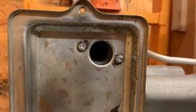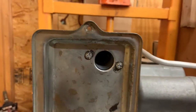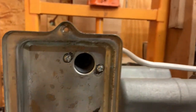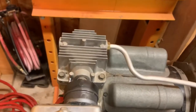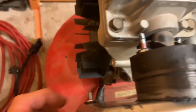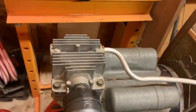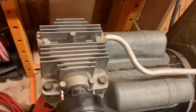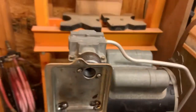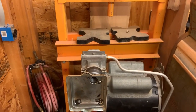And you can see, go straight in there. The adapter cleared the nubs there on the inside. Sealed everything up with RTV, even the nuts here on the back and the nuts on there. Everything's got Loctite on it, so it should never vibrate loose. So all that's got to set up, but we can do some testing here without really having to worry about it.